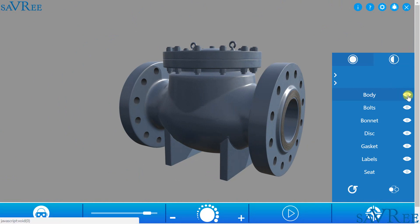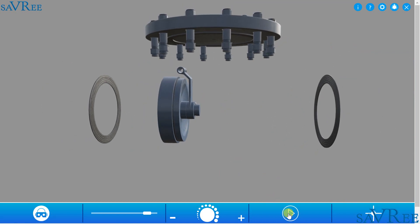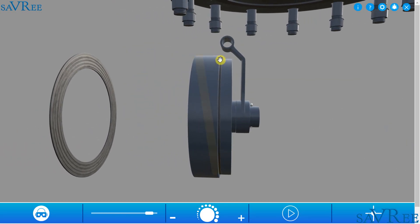Let's now take another cross section so we can see how that works from the side. In fact, we can actually just remove the body and we can see we simulate the valve opening and then closing again. Sometimes you'll notice that the seat is slightly tilted. The reason we tilt the seat is because it enables us to seat the disc more easily, and the valve also seats better at higher pressures.